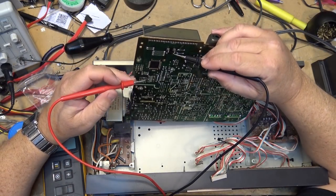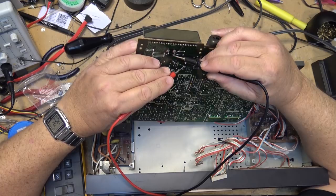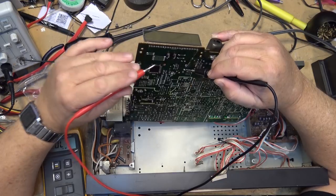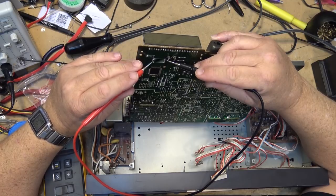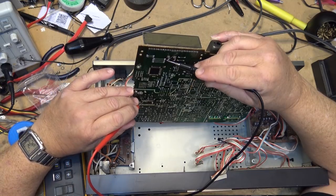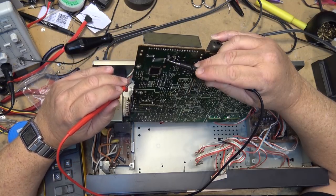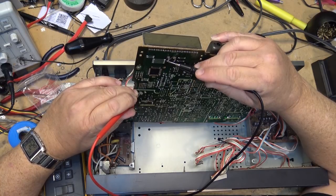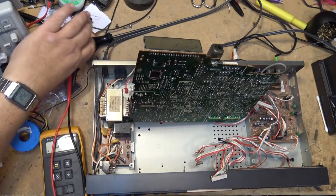So here's our terminals. That one's negative, because I went to the negative terminal of the battery. This one here will be positive, and this one's going to go down, probably down to a transistor that controls it. I'm thinking down here somewhere, maybe to this one. Where does this go? Goes to this lead here, which comes down here, and it goes to a regulator transistor. Okay, so that's the positive terminal there, because I'm going to Q509, which is a regulator, a transistor.